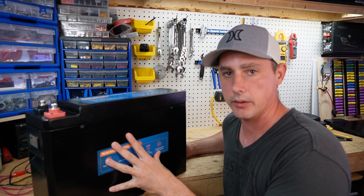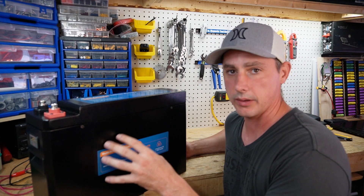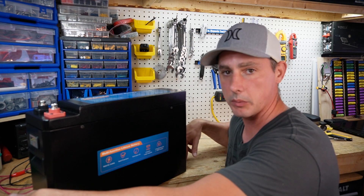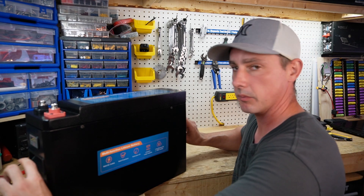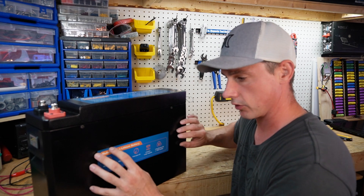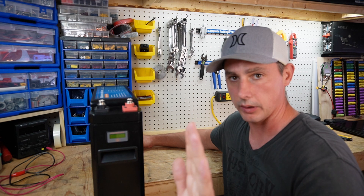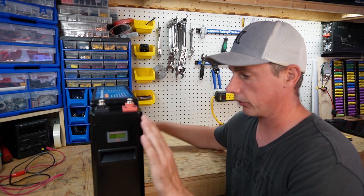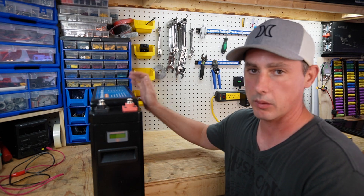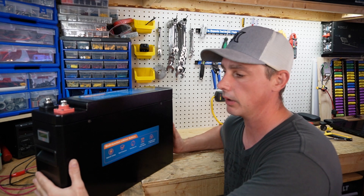I've got the battery put back together. This is the Leepower battery. All in all you've seen inside — great build quality, wire management was amazing. The only thing I didn't like was the temperature sensor was not affixed to the cells. I'd also recommend the company offer a strap that runs across the back so you can drill into the walls on either side, with some neoprene between the strap and case to prevent scratching. But the slim form factor means you can mount your charge controller, inverter, shore power connection — everything in a row — leaving an open area for your trunk. Leepower battery, 200 amp hour, passed all my tests, great battery, nice metal case — check them out. Links in the description below, thanks for watching!